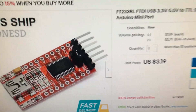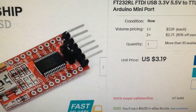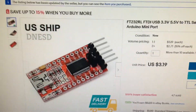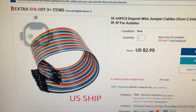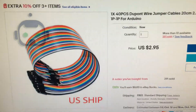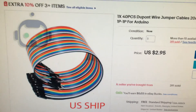All I know is what I did — I put the ground and the RX and TX lines to the A and M pins on the port and it worked. You could just click the jumper wires right into those ports. And if you're on a laptop you might be able to just stick it straight into your USB port without needing extra length.